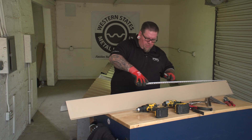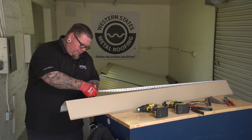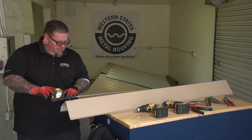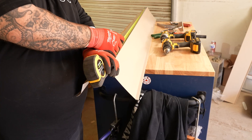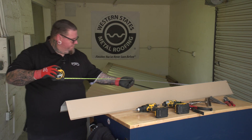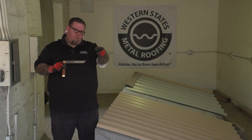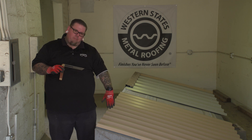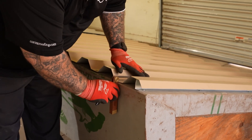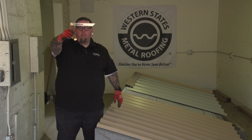The measurement is 63 and a quarter. I'm going to add an eighth of an inch so it wraps around and overlaps the back piece, allowing me to make a nice clean butt joint. To get the angle for the gable piece, I'm going to use my T-bevel to line it up on the back so I can recreate the same angle. You want to put it flush right here — just like that — holding your angle for your piece so you can do it in one cut.